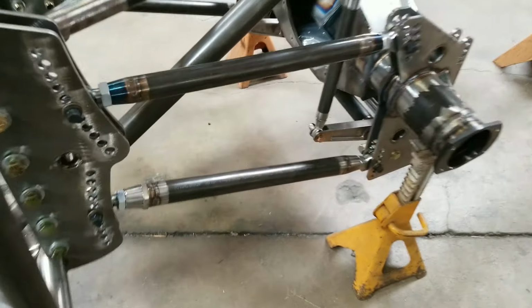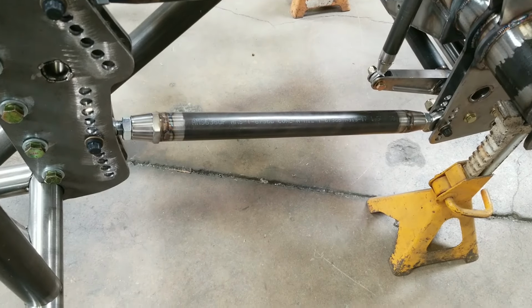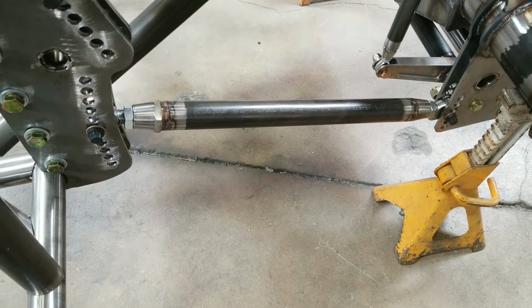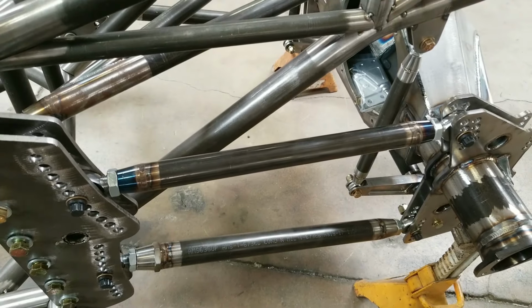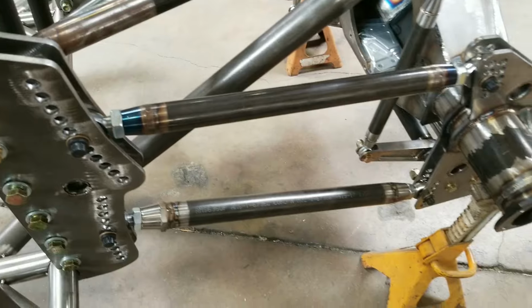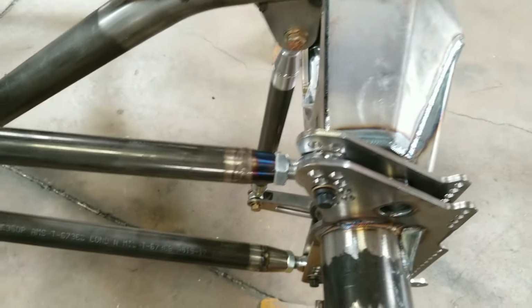I've been doing the lower 4-link bars, 1.5" 120 wall with nice Mercier bungs in them, because that's the push side of the 4-link. So I make those 1.5" 120 to help save some weight. The upper is 1.25" 120, still with Mercier weld bungs, chromoly rod ends, nice 12-point bolts, NAS hard washers, you know, the kind of standard nice stuff. Anti-roll bar lands in the same spot.